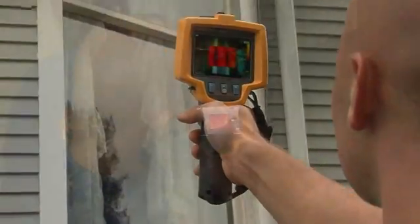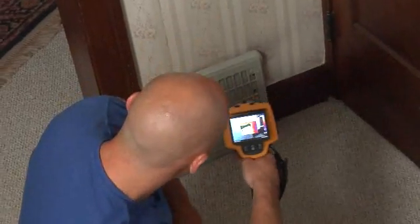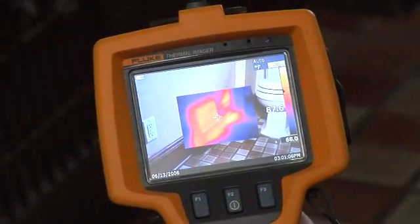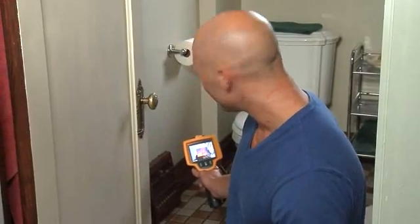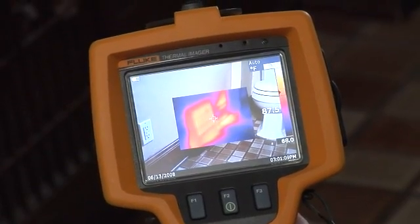When you're inspecting a home for sale or for renovation these days, you're going to run into the question of energy efficiency. It's on the mind of everybody who's paying an energy bill right now. The Fluke TI-R1 Thermal Imager is a great way to check for heat loss in ductwork, walls, and around vents. This hundred-year-old house had quite a few areas that could use improvement. Now ideally, when you close a vent, you want to eliminate all the hot air coming through it. Take a look at this closed vent through the Fluke TI-R1 — these old vents just don't seal very well, and you can see the energy loss. Now we're in the upstairs bathroom, where we found another issue that's widespread through the ductwork in this house. If you look at this closed vent through the imager, you see the heat is coming out all four sides. And if you look just to the right, it's actually coming out above and underneath the baseboard. That tells me that we've got some poor duct connections and really minimal insulation, and all that's going to cost a homeowner in lost energy.